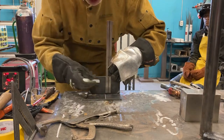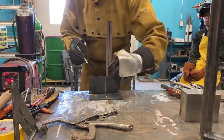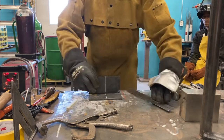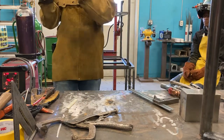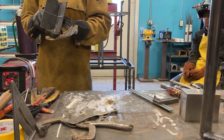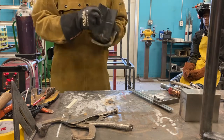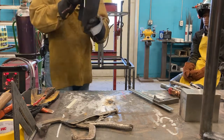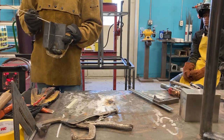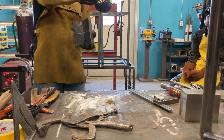1, then I go this direction. 2, and this way I can move a measurement around the surface. 4. So now I've got my line moving around the right angle. So it's like a quarter inch of line. That's the way the first weld's going to be. Your weld's going to start up top here. This is your end point, okay? So when we weld this, we're going to start here, weld across, go across the corner, and finish over here. And then on this side, we're going to start over here, weld this way, and finish over here.